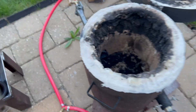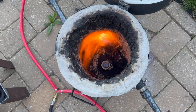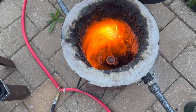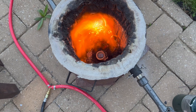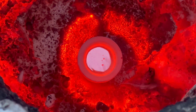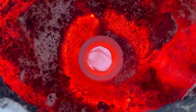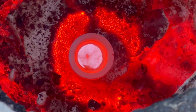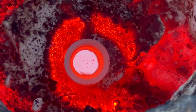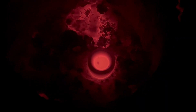We carry this out in a furnace in a cupel. The cupel is made out of bone ash, which absorbs the lead. It does this through oxidation of the lead, which then gets removed and absorbed as lead oxide. The precious metal will not be removed because it won't oxidize. Actually, silver does this really cool thing where it makes silver oxide, but it's too hot in the furnace for that to be stable, so it converts right back to silver metal. After a while, the boundary where it's soaked up lead no longer moves, so we know that it's done and we can take our cupel out and let it cool.